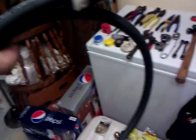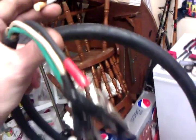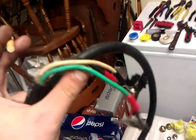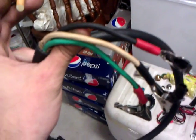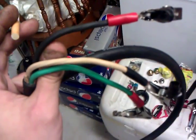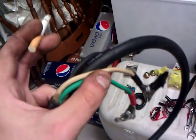After that, you cut one end, splice it, and hook up a female plug on one end. On the other end, you splice it and buy three alligator clips. Your black is your hot, your white is your neutral, and your green is your ground. Now if you're working on a three-phase 208 system and you only need 110 volts, you hook up the black to one of the legs on the disconnect, and the white which is neutral to ground, and leave the green ground alone.